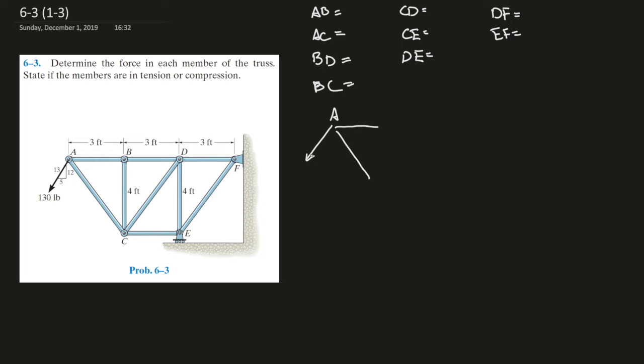Since this force is going down, there must be a force going back up to counteract the y forces. And since there are two forces going to the left side of the x-axis, this force must be going this way to counteract the x-axis forces coming from these two. This force is 130 pounds, and the other one we don't know, but this is equal to AC, so we can find that quickly.